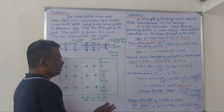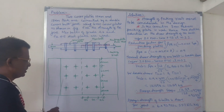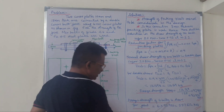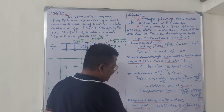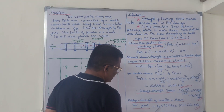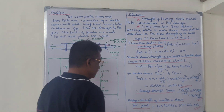Now we have the value per bolt. We have 6 number of bolts. So the design strength of 6 bolts in shear for the joint is equal to 6 × 92.935 kN, which equals 557.61 kN.